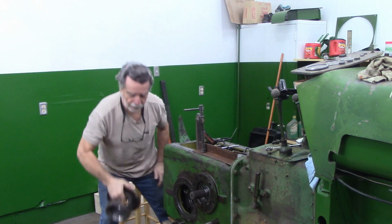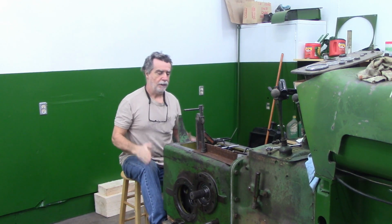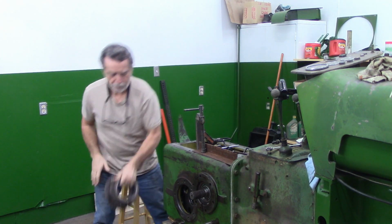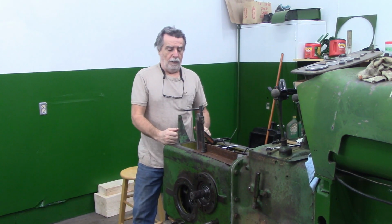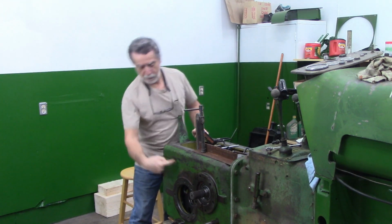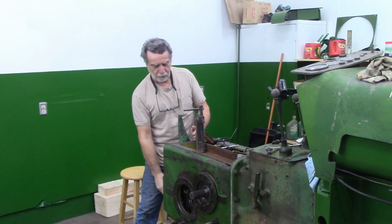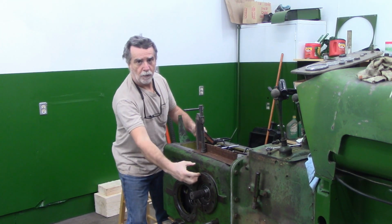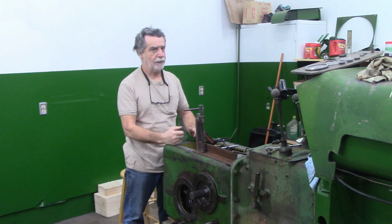There's also an O-ring in here that I'd like to change, and I've got O-rings for both sides. The one that's on this side is going to be a bit of a problem. The bull gears, of course, there would be a small pinion gear in here, and the bull gear goes into here. The bull gear on this side, I'm able to roll it far enough back to take that off. But when I was trying to take that piece off of the 510 final drive, the bull gear that's sitting in behind here comes up against the gear for the low speed PTO, and it won't allow that gear to roll back in order to get this piece here all the way off. I can get it far enough out to get the shims because I did it on the other machine. And like I say, those shims aren't going to help me.